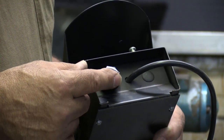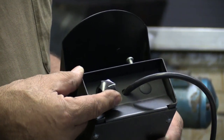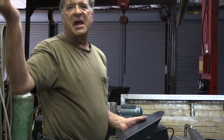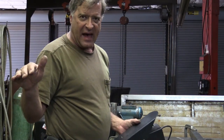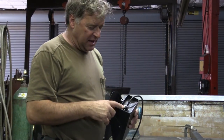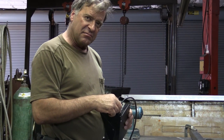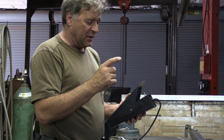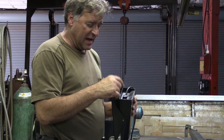The other reason I wasn't happy with this pedal is that the amperage control is here on the pedal. So what you'd wind up doing is you'd set the machine max amps — let's say 100 amps — and then you'd come over here and dial it in a little better, to how far you want it to go. It would be zero here and it would be whatever you set it at there, but you'd have to do it here on the pedal.